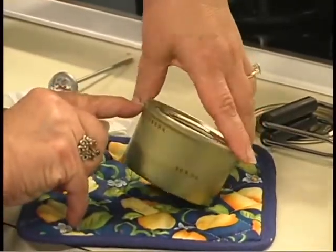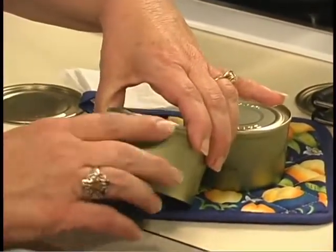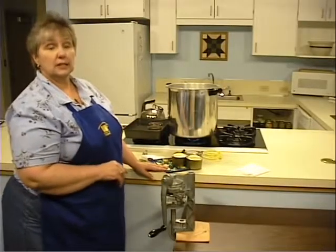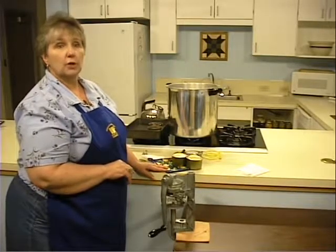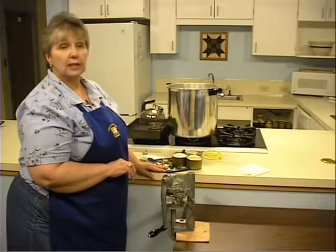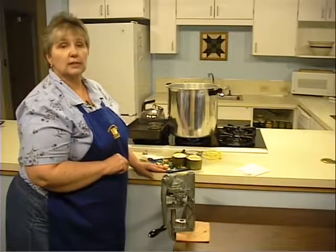Check that there are no V's or droops in the seam. Here is a good example of a can that has a droop — this seal would be compromised. After sealing, inspect each seam to ensure it's completely sealed. Check for sharp edges or drooped edges. For the safety of the product, if a seam is formed incorrectly, the meat must be removed from the can, packed into a new can, brought back up to 170 degrees, and resealed.